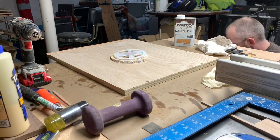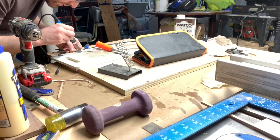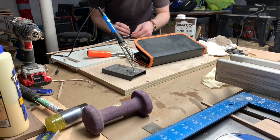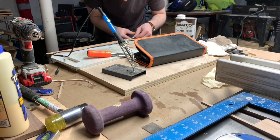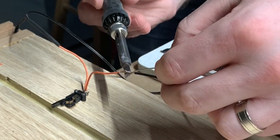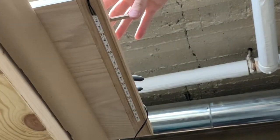Time for the lights. I had this leftover LED strip tape stuff. I dug out the soldering iron and a spare 12-volt power supply, and essentially we're just going to wire the lights to a contact switch to the power supply. It's going to have a little plunger piece that makes it open and close when the cabinet door opens and closes. This contact switch was salvaged from some trash alarm clock I dug out of the dumpster, and it needed a little bit of cleaning on the contacts. I've created a refrigerator light. How exciting.